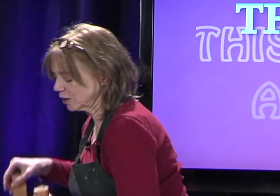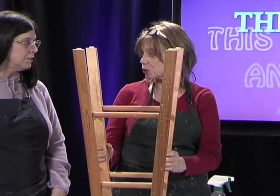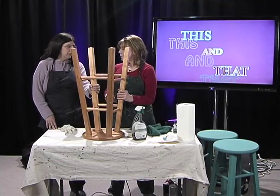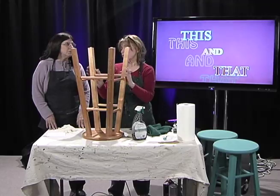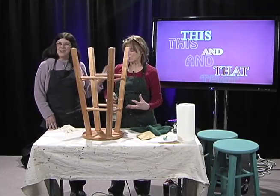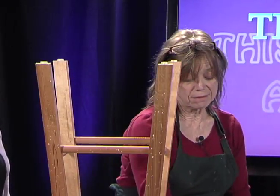So here is a stool that's been sitting around for a while. The preparation is probably the most important thing when you're going to start a painting project. Cleaning and prepping your piece of furniture creates a tooth so that when you put your paint on, it grabs and adheres properly. If it's not clean, the paint's not going to adhere. If you have a piece of furniture, do not use things like Endust or Liquid Gold or anything that has an oil or wax base, because that's just going to make it run and it won't grab. I use Simple Green and you don't have to rinse it off — just spray everywhere and clean it.